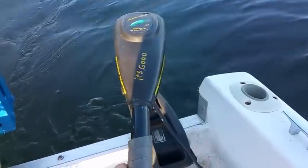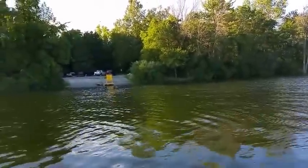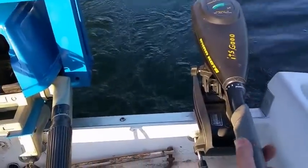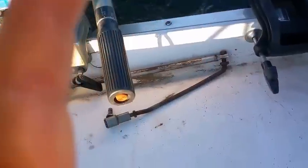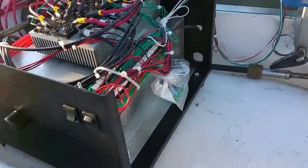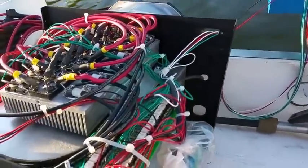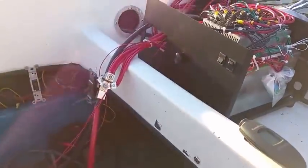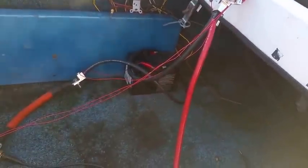It doesn't go very fast, of course — it's not meant to. You can see an idea of how fast we're going. We're getting set up. We've got a jumper here like we had before. This is the primary battery — we have this connected at 12 volts, 24 volts for the motor. The controller gets 12 volts; that's very important. That drives the opto board right here. This is the top portion, Group 2 — Group 1 is underneath there.